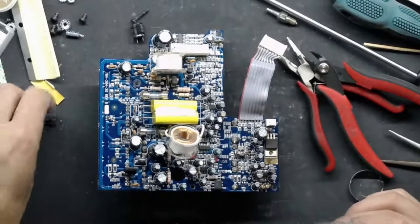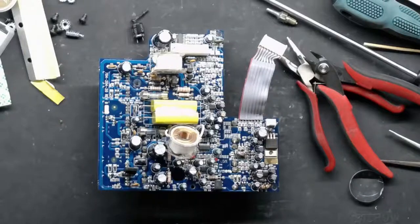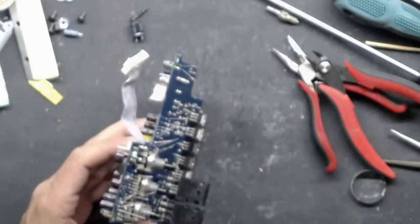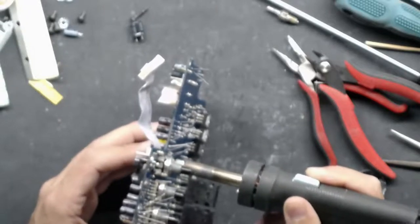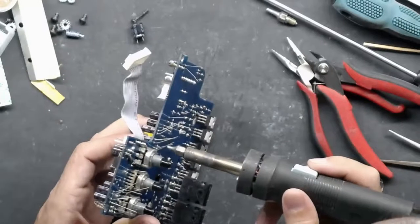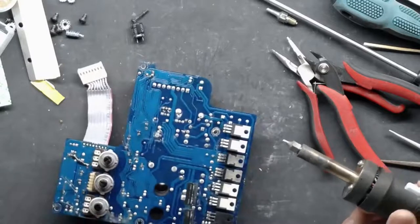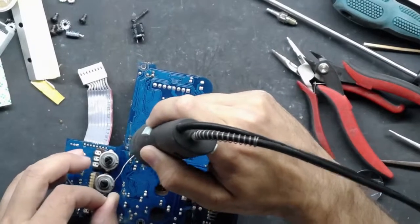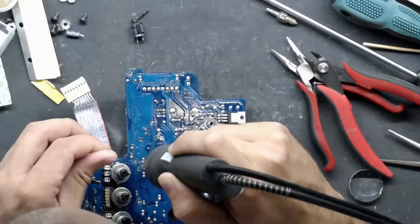The other thing I don't like is the drivers on the woofer. They don't use foam on the surrounds — they use a thick rubber. It's okay that they did that, but the problem is you can't find it anywhere to repair it once it goes bad, and rubber dry rots. There's only a certain amount of life rubber has. Unless these things are exquisitely maintained, you're going to run into issues, and once they crack that's it. People do use glue to try to hold them together, but it doesn't look good and the driver usually needs to be rebuilt.